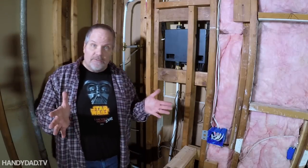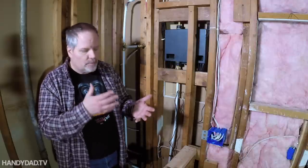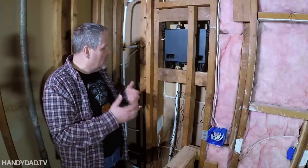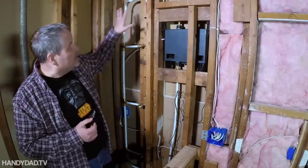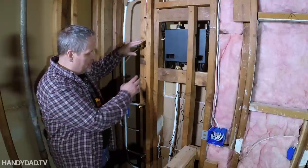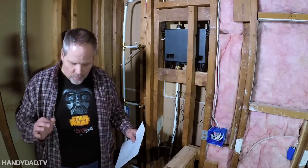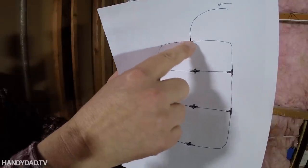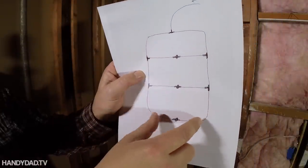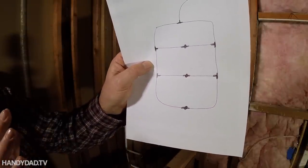I got my rough plumbing inspections done this week and passed. When you pull permits you get the advice of inspectors — they protect your house and occupants, ensure code compliance, and give free advice. The inspector looked at my setup and said he wasn't going to fail me but that it wouldn't achieve balanced pressure across the three heads. He drew out a pressure balancing loop design where the water comes in, hits a T, goes in both directions down the loop, and feeds into the shower heads evenly from both sides — that's a perfectly balanced pressure loop.